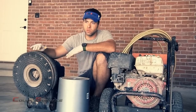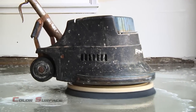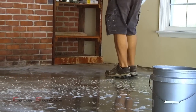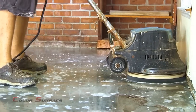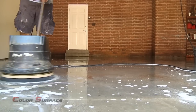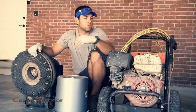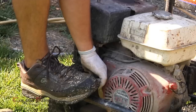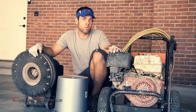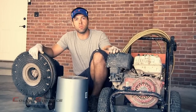We do not do that. We do do an acid etch. However, we use a heavy duty orbital floor machine that has this heavy duty scrub brush here, which you can see the tough bristles. So when you put the acid solution down, this will scrub heavily into the surface and it will open up the pores and remove the cream or the top of the surface that is left behind so smooth. Then when all that residue is brought to the surface, we have to rinse the surface. So we use a 3700 PSI pressure washer, which will blast out all remaining dirt or residue in the concrete to remove any remaining residue that might become a problem later.